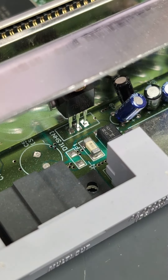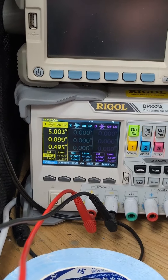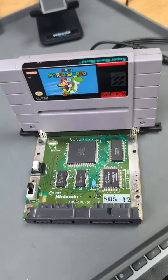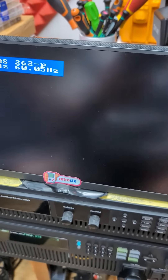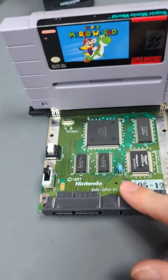Let's put a new one on. Before we solder the new fuse on, let's just inject 5 volts here to be safe. And we can see we've got 100 milliamps, so there's no short. So the new fuse is on — let's give this a try now. And there we go — we've got audio, we've got video, obviously composite. So it looks like the only issue on this fault-wise is the fuse.